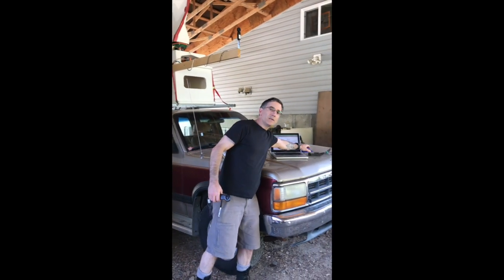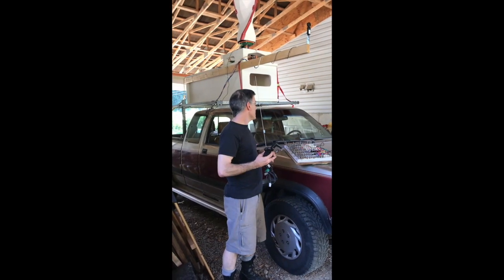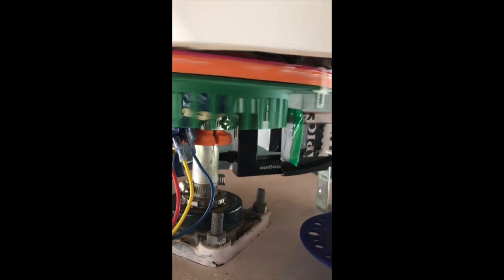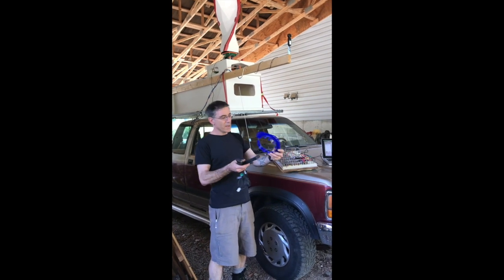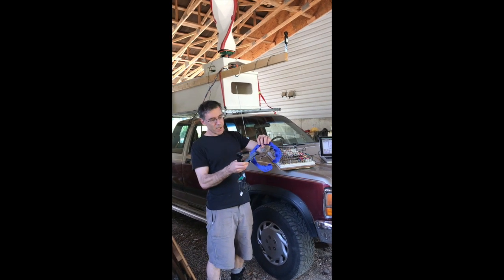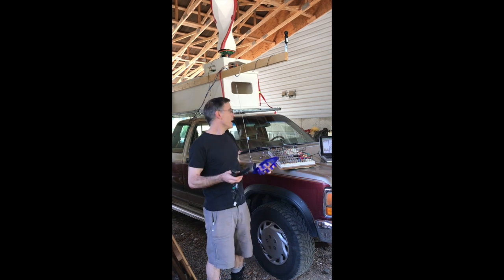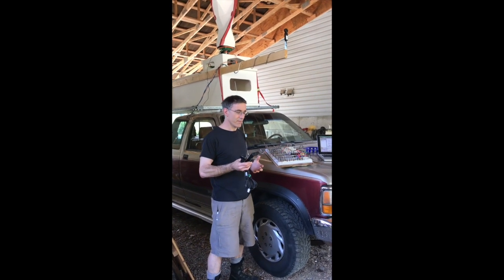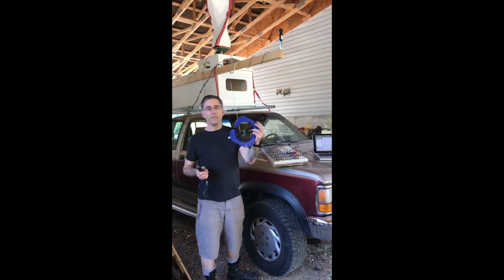The next thing you have to know in testing a turbine is, once you know the wind speed in, how fast is the wind turbine going. Up there there's a green toothed wheel, similar to this blue one, and that toothed wheel passes past an optical gate sensor. Every time it passes a tooth it sends a signal, and the data collection system can measure the difference between those signals to figure out how fast the turbine is turning and whether it's accelerating or decelerating. So this gives me wind speed in and these give me turbine speed.